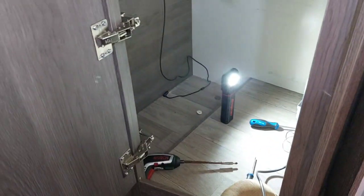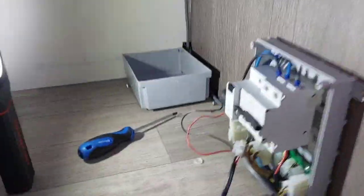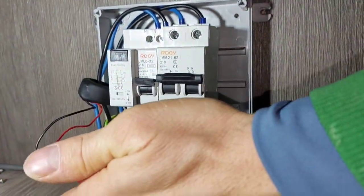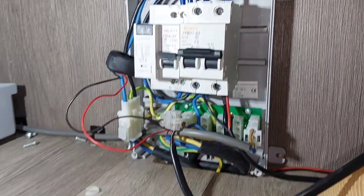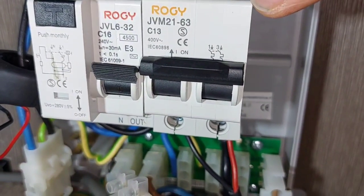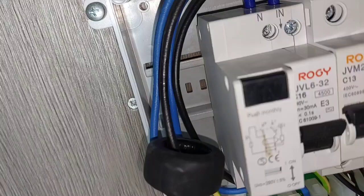This is the i56. Just inside the wardrobe here is where the power comes in — the 240 volts comes up through there and into the top. It looks like it's going through a 16 amp MCB and then out, going back around through what looks like a 13 amp. This little device — you can see it looks like a donut — just goes on the live side of the incoming supply.